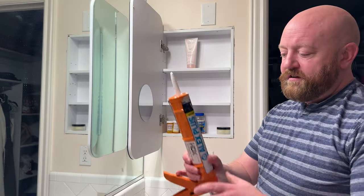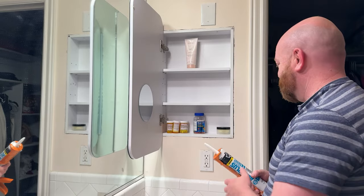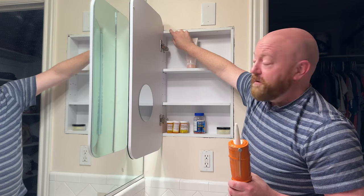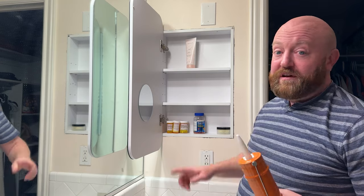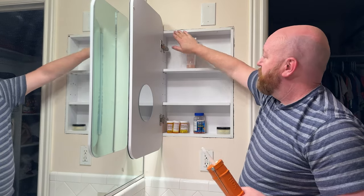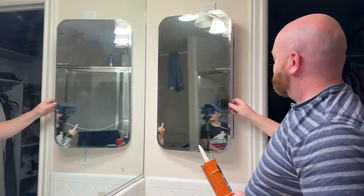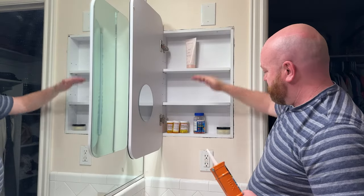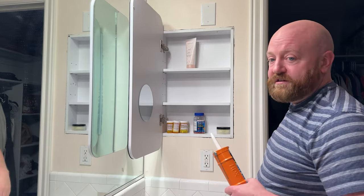It's a new day. I've got some caulk and I'm going to finish this up — I'm really excited about it. I'm pleased with how everything turned out. I do think the reason this side is pushed out a bit is because the power cord is right behind that back corner, but I don't want to deal with it. This plate is so low that if it were flush it would hit — lesson learned: I've got to give myself the full space between the junction box and the outlet. Anyway, I'm very pleased with it and I'm just going to make the edges look pretty.